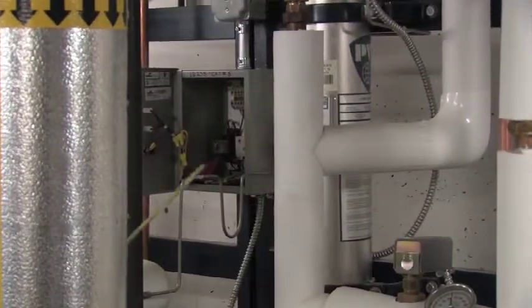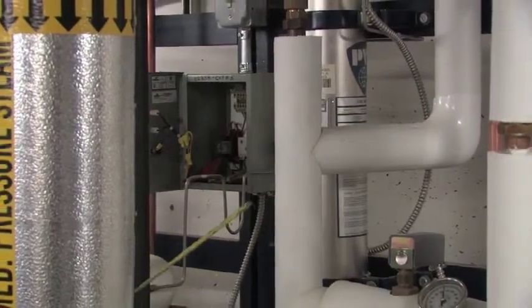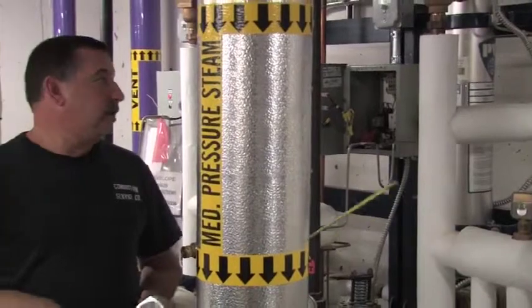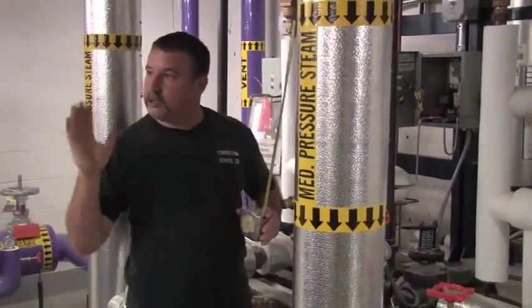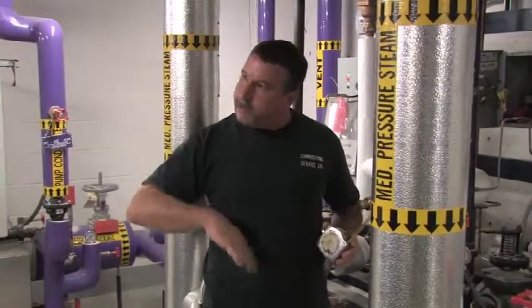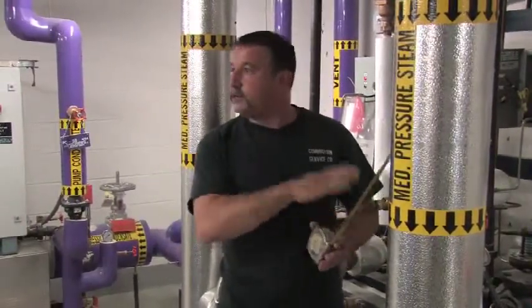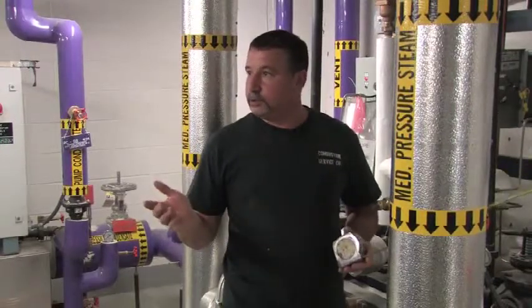If they come within 5 pounds of each other, in other words, if you shut off the water to the building and the water pressure drops down below 50 psi, then it's going to activate a time delay relay because they don't want nuisance calls. If there's ever a quick dip or a problem where a pump goes to generator and there's a small dip in the pressure, we don't want that to cause a nuisance problem.